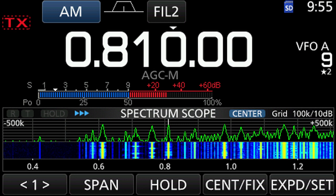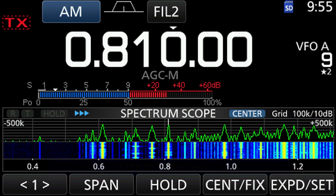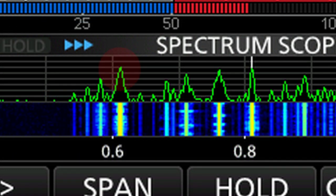This is a screen capture that I took from the radio when I was playing around with the filter earlier. If you take a look at the upper right corner where the grid legend is, it says that the vertical lines represent 100 kilohertz and the horizontal lines represent 10 dB steps. Let's take a look at one signal here just above 600 kilohertz — you'll see that it's just about on the second line down from the top, so 20 dB down from the very top line.